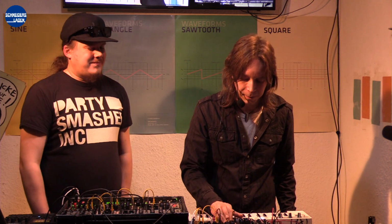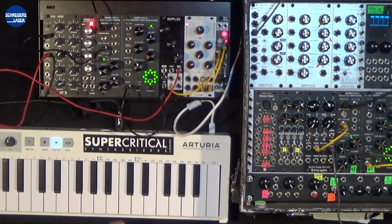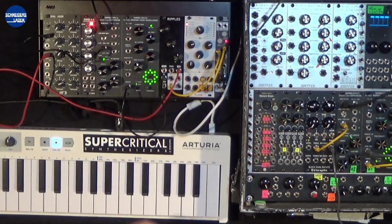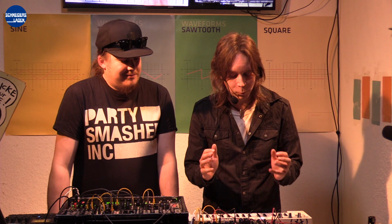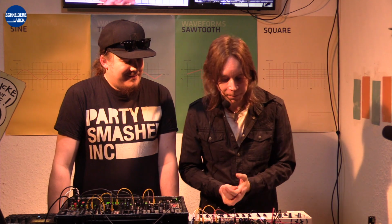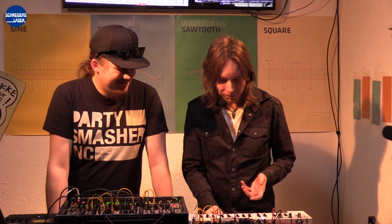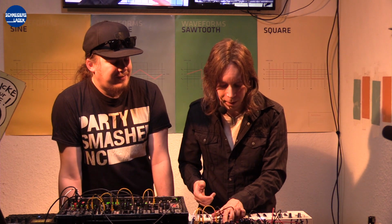So there's a lot of hidden state that you don't see from the front panel, so you might get confused. One thing is that pressing down these 3 buttons at the same time and holding them for about 2 seconds will reset the module. It resets all the hidden state, and all of these potentiometers get reset to their current panel setting. So that's your escape route. If you don't know what it is doing and why, you can just press that and you're back to safe ground. Back to Kansas. Yeah, exactly. That is a good habit to learn, to always start from that.